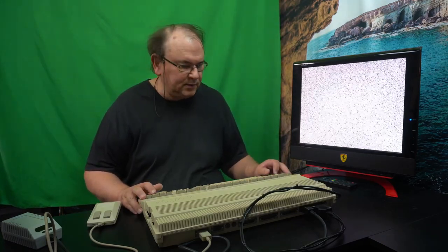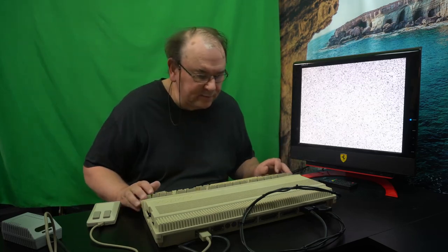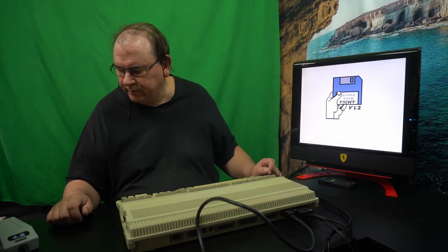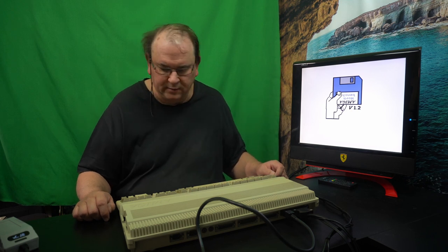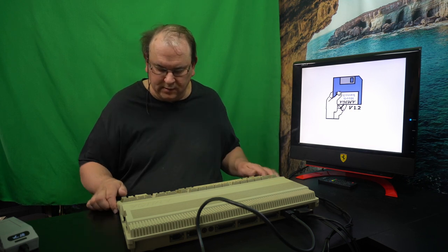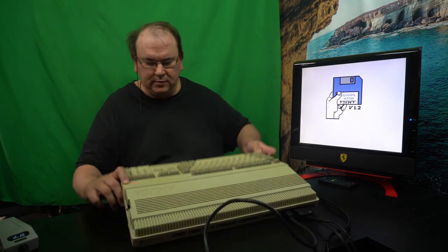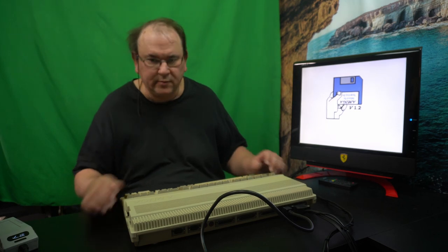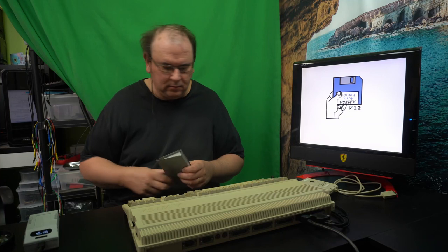Could be a connection problem. So what I'm going to do now is take the module out and put it in a couple of times. I'll do that offline and then come back and see if we get a better result. Well, the good news is that I decided to take the memory module out and try to start it, and then you just get this continuous red power lamp. So it didn't seem to break the unit. So let's continue from that.